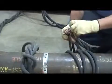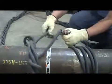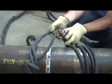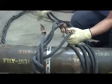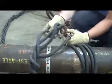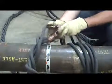Using a longer bolt than previously used to connect to the bus bar of output 1, pull the 4 lugs on the 4 cables through the bolt. Now pull the other 4 lugs from the other 4 cables towards the bolt, so all 8 lugs are connected to the 1 bolt. With all the lugs pushed tightly against the bolt, the hardware can be mounted.